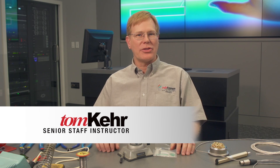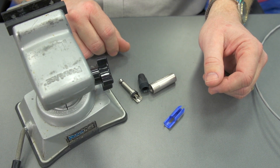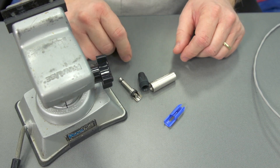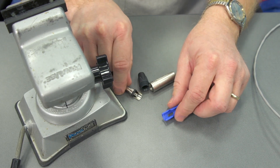The next one we're going to do is a quarter inch tip sleeve to male RCA cable. So we're going to inventory the parts here. Manufacturer styles will vary a little bit, but we're still going to have the same basic components: the connector itself, the shell, the boot that goes on the back, and this part which is the strain relief.